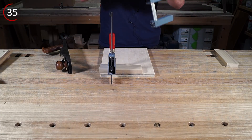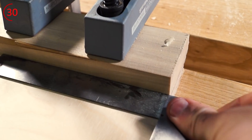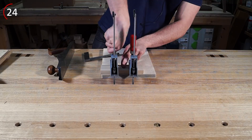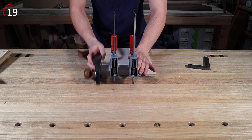I've got a flat bit of plywood on the bottom, two clamps on that back fence keeping it all in place. I'm going to square this back fence up with the edge of the plywood, and also make sure the fence is overhanging this side by about a millimetre. Crank this down — really wrench these round because that's going to be what holds your fence in place.